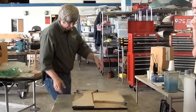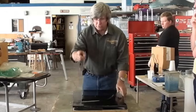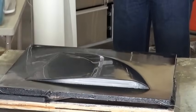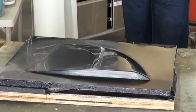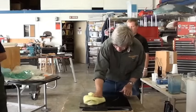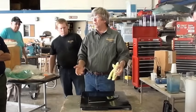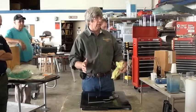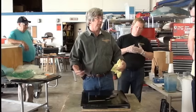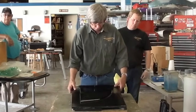And so when we get that done, here's what we're left with. There's that part, but it's down to the stage where we've got some paint on the thing. And that paint is just a regular old two-part epoxy polyurethane paint, something like that makes it shiny and makes it slippery. After it's cured, we will wax this thing 10 times. Wax and buff, minimum of 10 layers of wax is the first go around. Once you've got the 10 layers in there, then you're good to go.